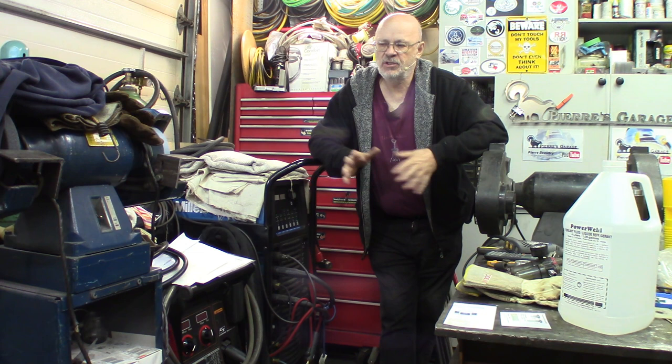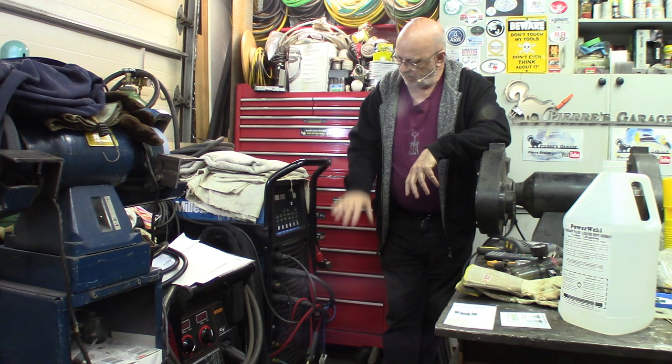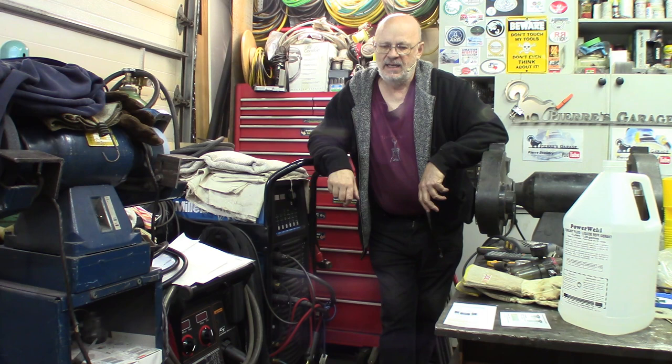Normally TIG and stick machines, if you don't have any special features and not much extra stuff on it, it's easy. Clean up the fans, clean up the machine a little bit, make sure the fans work properly, check the cables for cracks or defects or whatever, and that's about all they require.